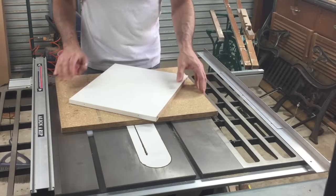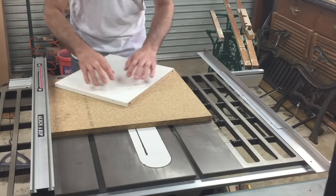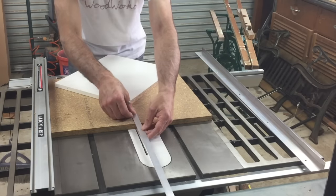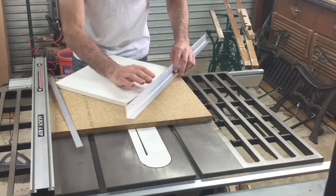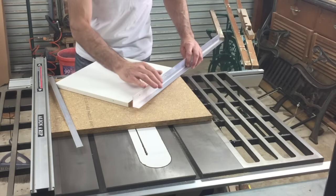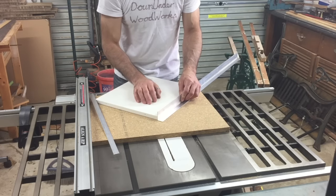We'll mount the base onto those runners. I'll cut this backing board down to a square and that's going to sit on the base. In the front here I've got this very thin strip of aluminium — I think it's one millimetre. I'm going to insert two strips, recessed in the board along the edge of that backing board. I'll also have this one-millimetre aluminium angle with a piece sitting here and a piece sitting there. I'll mount them onto the board and after they're all in place, then I'll cut the kerf through the sled that way.